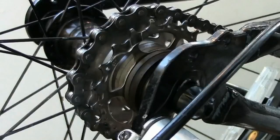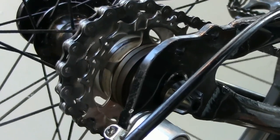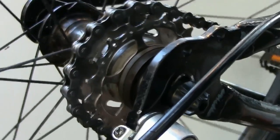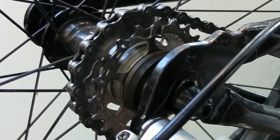A worn, elongated chain sits high on the teeth at the top and bottom of a new sprocket. As each roller comes around to the top, it is carrying almost the entire load and then it pops off a sprocket tooth. Look at the back of the sprocket to see how the rollers jump forward without reaching the teeth as the roller at the top pops off.